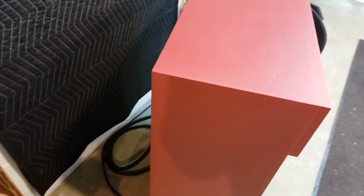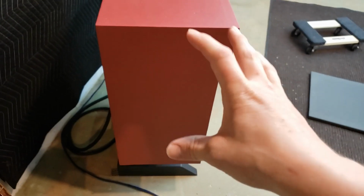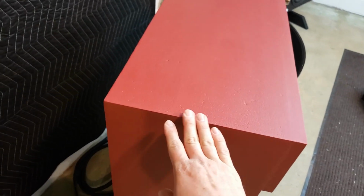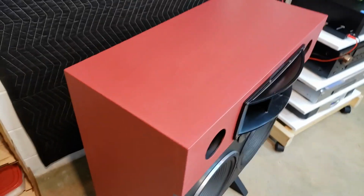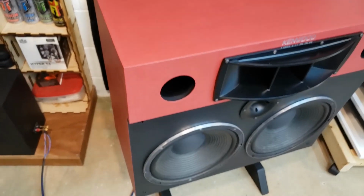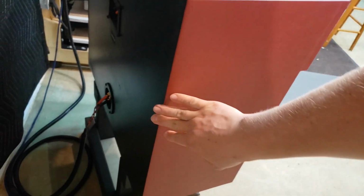It was on there. And then from there, all I had to do was sand it smooth to get my right angle, my good shape, back on there. I did that on all the big spots that were missing big chunks, and then all the smaller spots along these edges on top and the corners, I just used the premix Bondo, globbed a bunch on there, sanded it down, and tried to get the nice corner back. That was probably the most work. These were so beat up around the edges, and trying to get all those edges back nice and square was probably the most work.